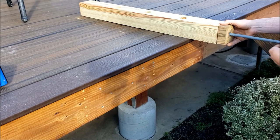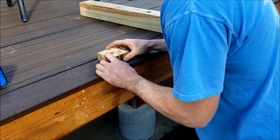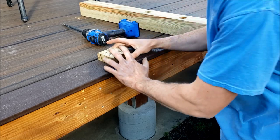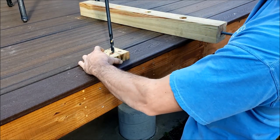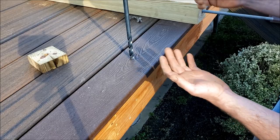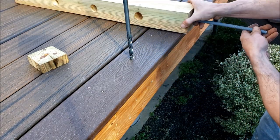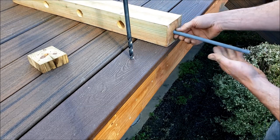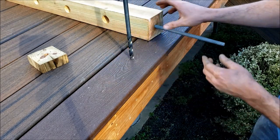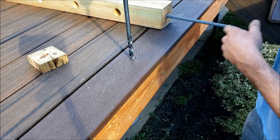Next step: to mark the half inch hole, I have this piece cut out with the center hole and put that right where it needs to be. I have my four by four traced out here, hold that, and get the hole started. You could run this straight down through or go at a slight angle to try to tag both joists. The hole doesn't have to be perfectly straight because once the all-thread is in there it's just clamping the post down flush, and that's what causes the post to be level — not how straight your hole is.